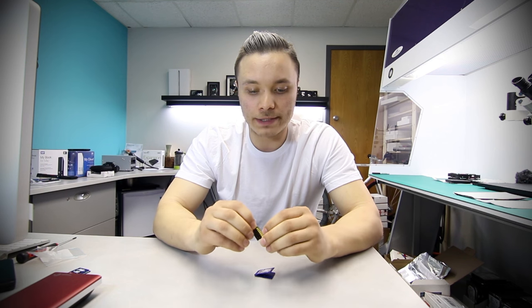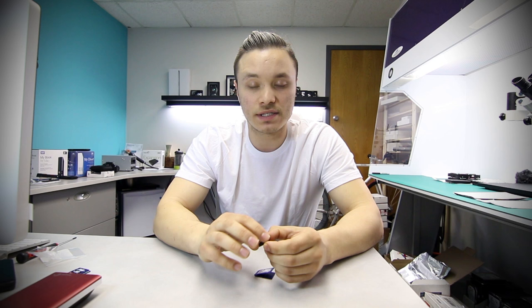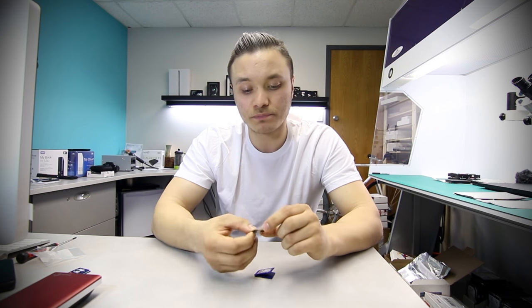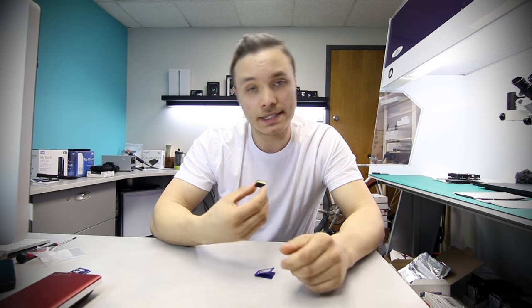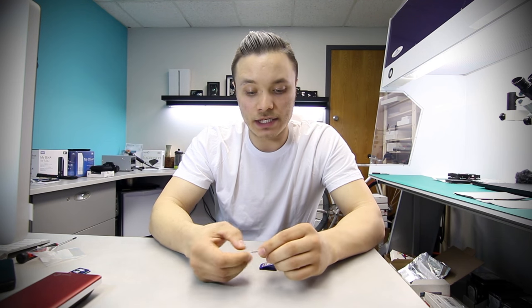If you pay attention to how both sides look, you'll see that one side is glossy, the side that's got the connections, and the other side has more of a matte finish. Now, the side that's got connections on it, underneath that glossy acrylic layer, there is a printed circuit board. We need to expose that printed circuit board and actually solder wires to specific positions.